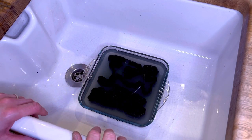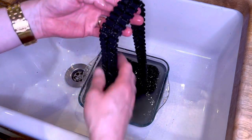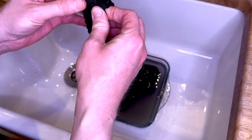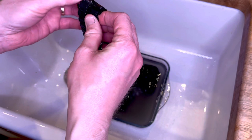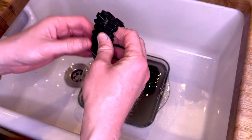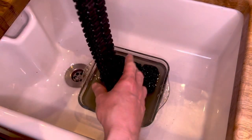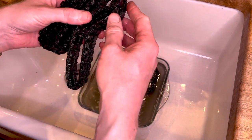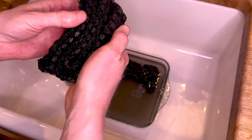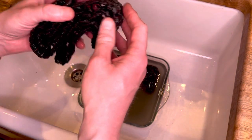This is — I must admit — about twenty minutes probably. But if you can see — black. What you want to do is have a look around at them and see if you can find any bits that have been touching, because if they've been touching they won't get the fluid on them and they won't do it. But to be honest, I'm kind of happy with that. They're going to be painted anyway. It just takes off the metallic without having to worry about painting them. And this shouldn't come off unless you sand it off. Also, paint always gets in the pins and stuff and then it's hard to get them out. With this it won't — it just darkens it for you.